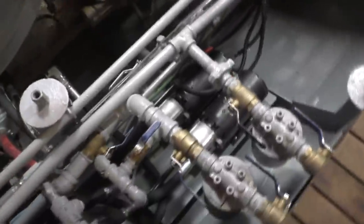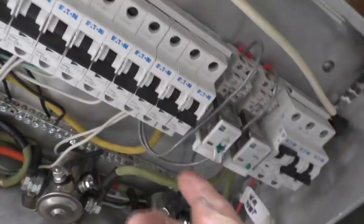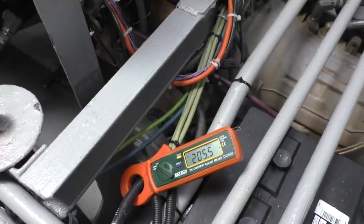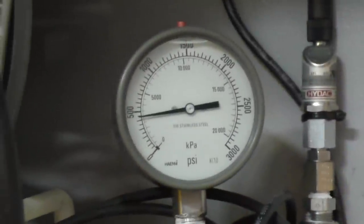You can sure hear them. The thing is we need to watch the amp meter and see what it's actually doing. The question is whether that breaker is big enough to start these pumps when they have to start loaded with pressure. It's all gone — sucked it all away. So we fill it up — it's oiled up. So it was starting under load — they did start. That's good. About 480 pounds on it — the breaker's got to throw. That's 200 amps — 204, 205.